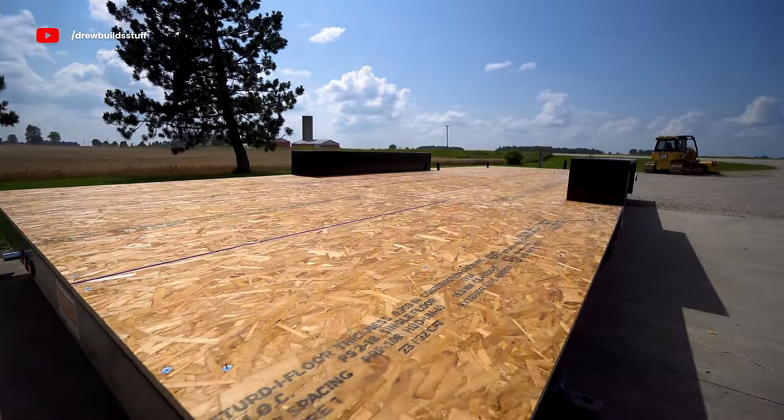So sheathing actually doesn't get put on tight, it has a slight gap between all the sheets. So I just use one of the nails, which is about 1/8 of an inch thick, to space the gap between all the sheets.